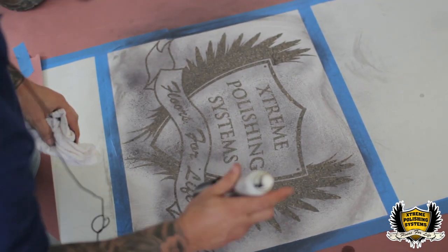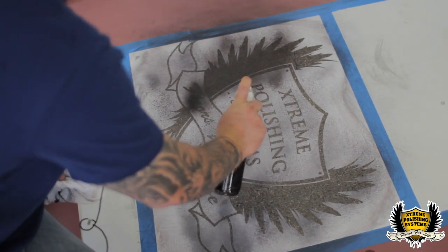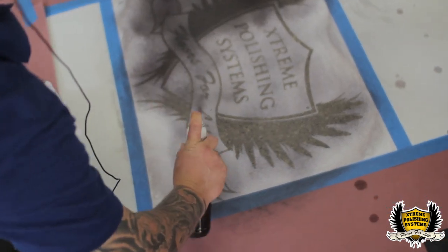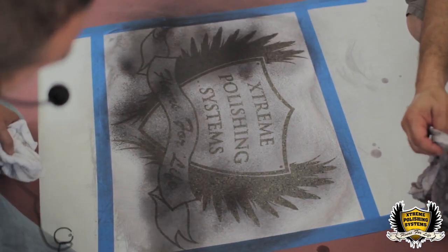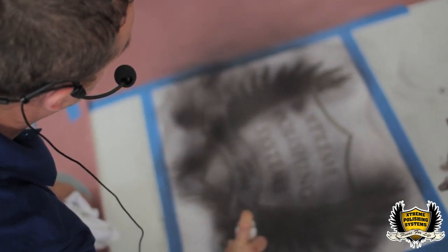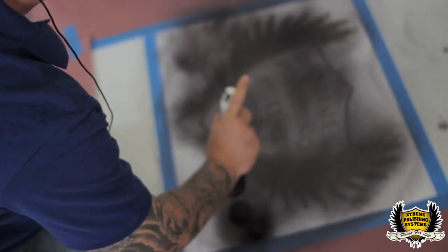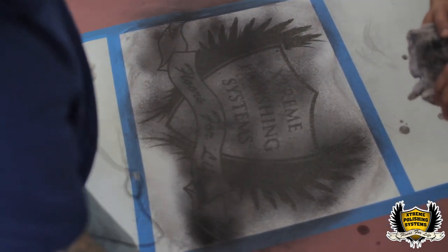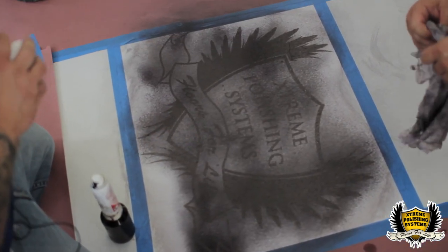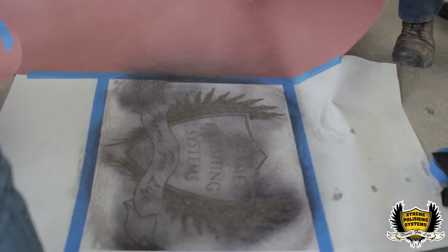I'm actually going to spray two applications. It'll help darken it up, but what you want to realize is the concrete is only going to accept so much dye. So if a customer says he wants a jet black floor, you cannot guarantee it's going to be a jet black floor. Because if I leave the dye like that, first time they wash the floor to maintain it, all that dye is going to release off the floor. Then you're going to be calling Chris up, Chris is going to be calling me up, and I'm calling back to you.